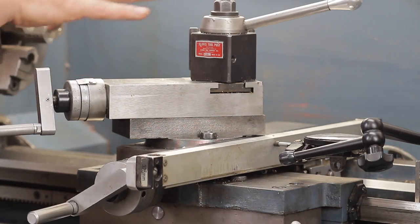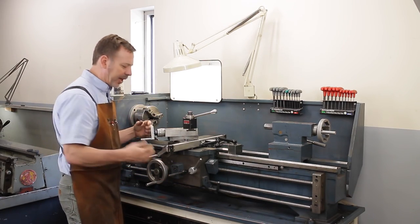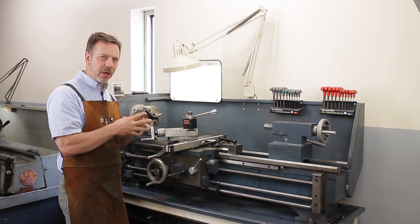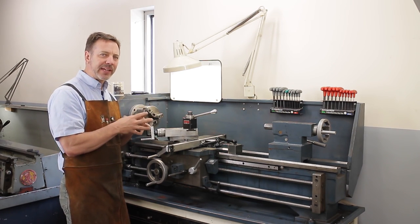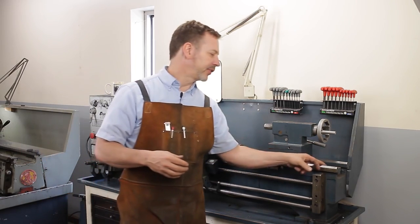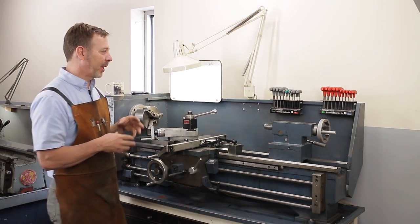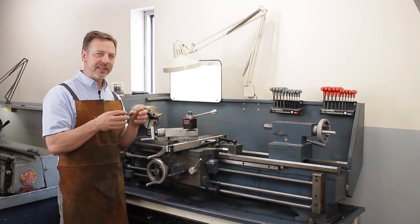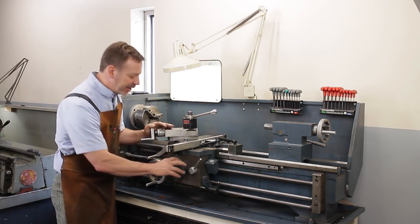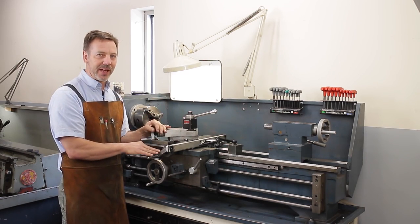And that's kind of the overview of the carriage. Like I said, there are different ones that will have clutches on them. You'll want to try everything you can. And again, when you made that initial phone call, find out what the number is on the lathe. Also, on the corner here of the lathe, there's always a serial number. Sometimes you can actually look up the serial number, like on a South Bend, and get the information of when it was made and find the documentation on it, so you can understand how everything works on and around this part of the lathe.